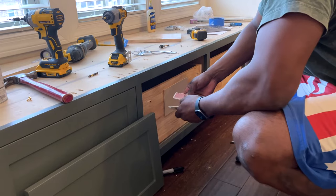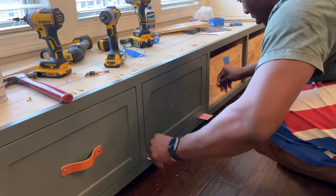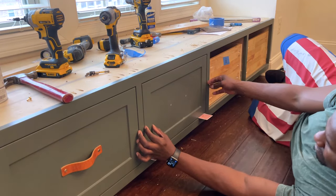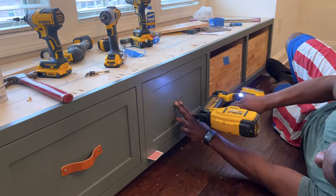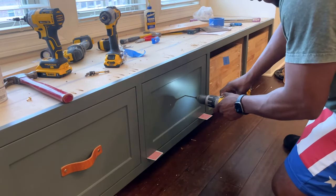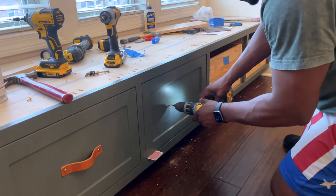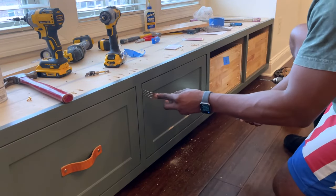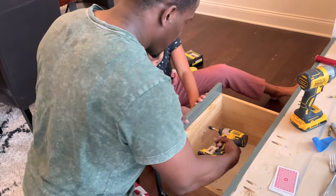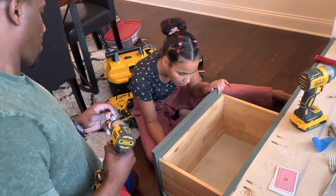Here I'm using the card trick — grabbing some playing cards to get the spacing right. I even it out for both sides, put the drawer front on to see where it sits, and if I don't like it I just pull a couple cards out. Once I have good spacing, I brad nail around where the hardware is going to go — the hardware hides around that hole and it keeps the drawer front on the drawer box when you pull it out. Those few brad nails are small, they won't come out the back, but they hold things in place. My assistant little Raleigh is helping hold the screws.